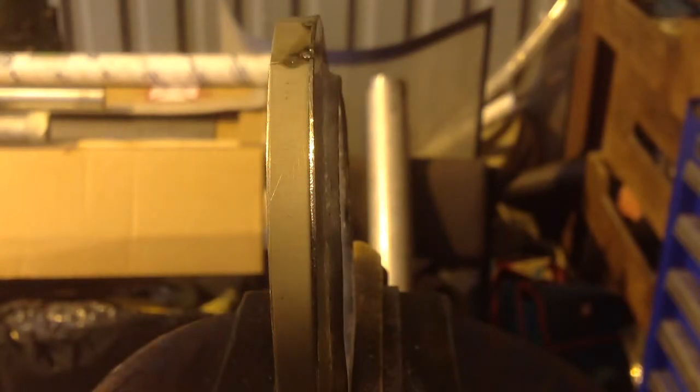I'm going to see if I can get you a good shot of this. When it's actually touching, it's the way to speed tack. I'm coming in there with my tungsten, rocking it right into the joint. I've got a gap there — I can feel it with the tungsten, so that's not going to work. I can still feel a gap. You can't work with a gap, even if it's only a thou, so we'll get some more grips on that and come back in a second.